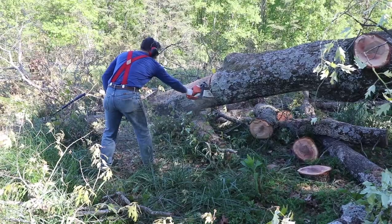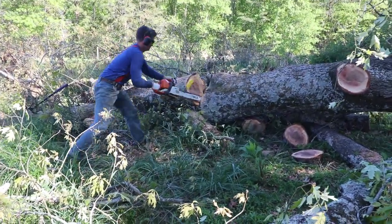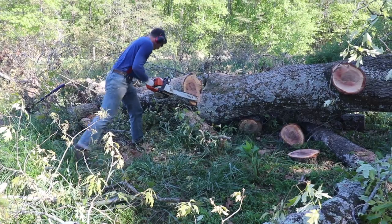To further brace the walls and create a nailing surface for the board and batten siding, I add bridging to the framed walls and complete things with a 4x4 top plate to set my rafters.